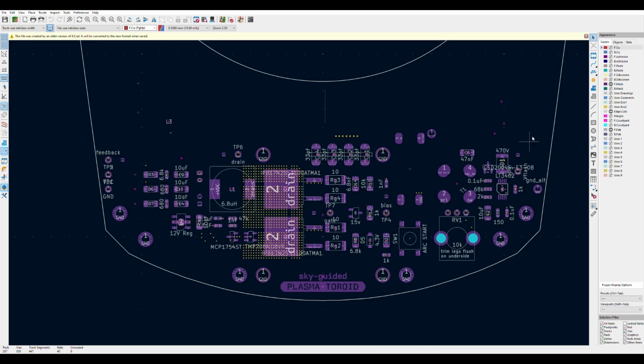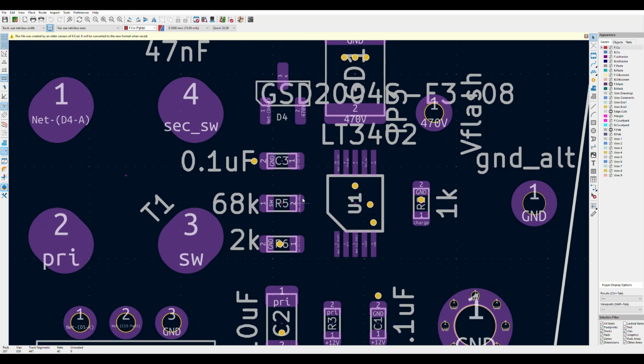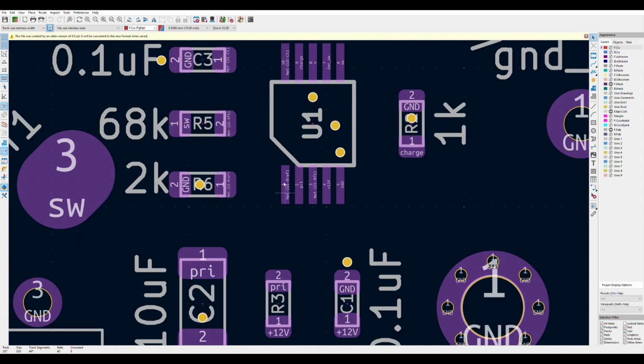But with the fab layer on, I'm going to zoom in on one of these areas so it's pretty clear what we're trying to do. So for components that are symmetrical, such as U1, I do need to make sure I've got the correct pin 1 so that I don't flip it around and burn up the chip. So I can see here the white outline in the fab layer shows one corner having a 45-degree angle. That's helpful to understand that that's a pin 1, and it's also confirmed by reviewing the mask. It actually does call out each pin, so this is pin 1.